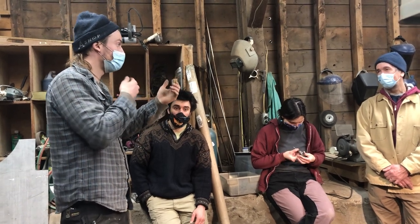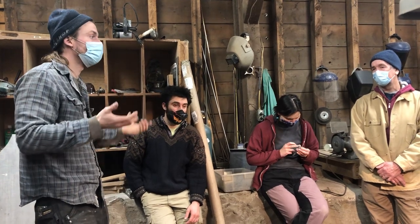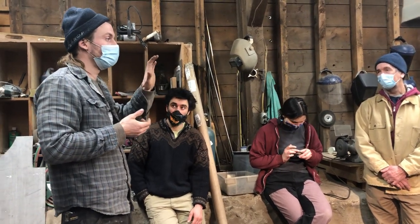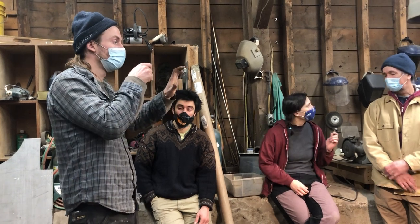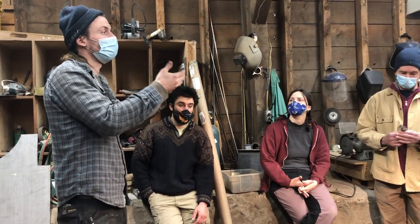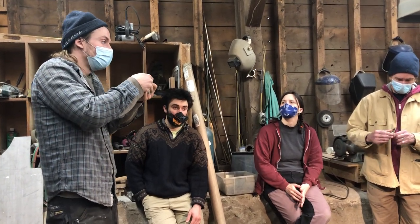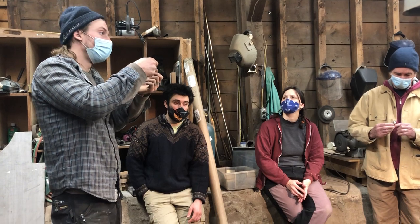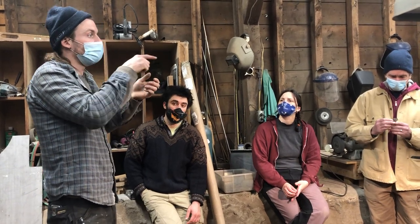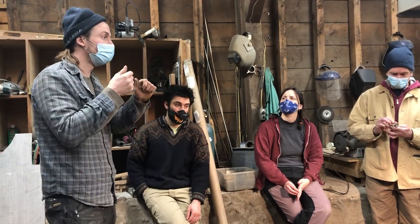It's kind of the way you use sandpaper on a wedge-shaped block with a clamp, the same idea, but now I'm just holding it there with my hand pressure, and it's just enough to get me started with that Forstner bit, and I'll drill out that bung. Instead of using a scratch awl to pick it out, where a scratch awl can dent the sidewalls of a bung hole if you're not careful, or a chisel.